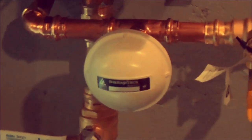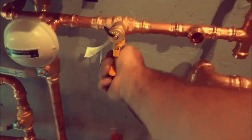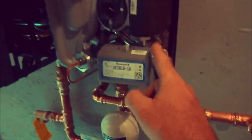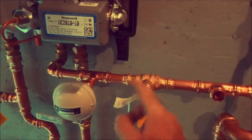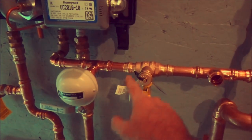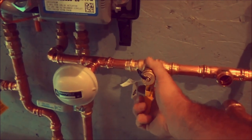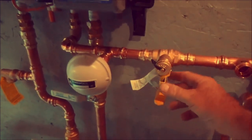That's the nut right there. It'll take care of your water hammer. You can see we got it on the domestic side. That's the three-way valve, so we can flush the plate heat exchanger that's in here. You can isolate the domestic and run a, this is the cold water, we'll have another hot water here. So you can run vinegar through the plate heat exchanger and clean out the inside of the coil. That's the on position. That's the off.